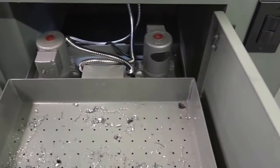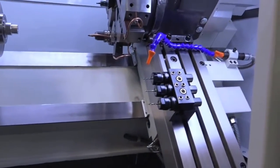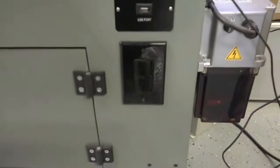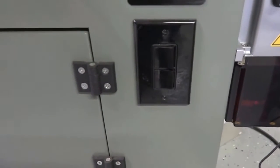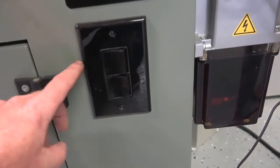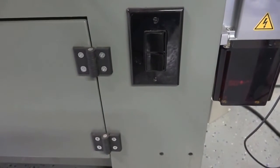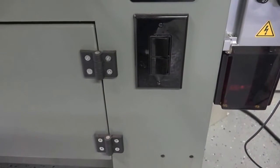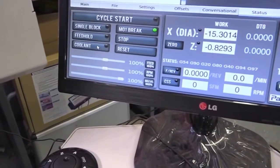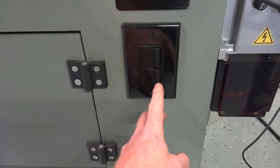Now the choice between turret and gang tool setup coolant — I did a very similar modification to my Tormach between my mist and my flood coolant. From the coolant plug I ran to the switch, and from the switch I ran two wires to the back of the machine and added two plugs to the end of those wires, then plugged one pump into each wire.